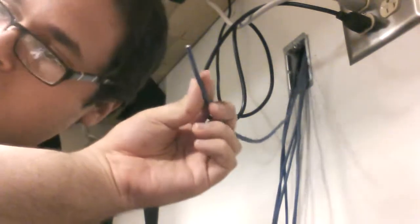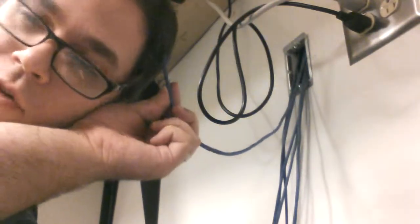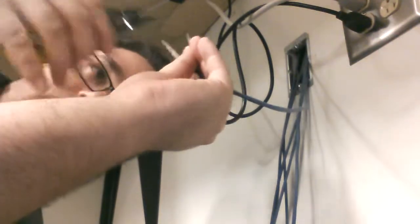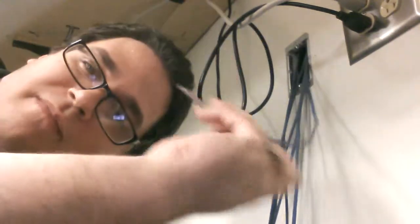So to begin with, we're just going to strip our cable. Now most people tend to use standard strippers for these — the standard strippers. I don't do that. I use these. I know they're great for cutting cable but they got a nice curve so you can strip the cable without much hassle at all. They're really sharp too, they'll cut right through that like nothing. Then I'll get rid of the little piece of Kevlar that's attached to these. I hate this little Kevlar — it's great if you have to strip down a long run, but man, they get in the way all the time.